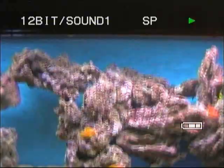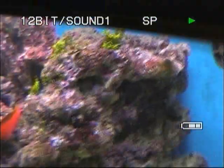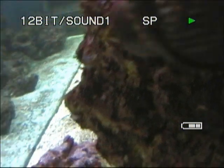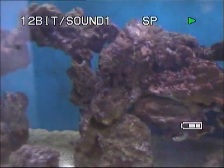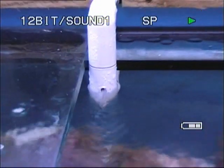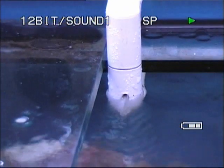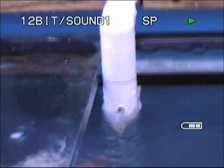I'll just lift the lid on the main tank so I can show you the most important little hole. So that's the spray bar. You can see here, right on the water line, is a hole. Now you can see water coming out of there at the minute. That is to stop the siphon.